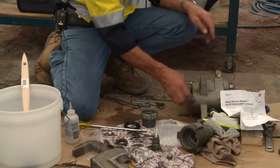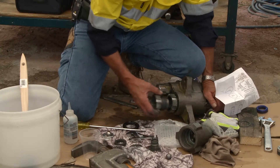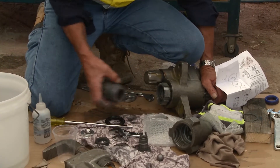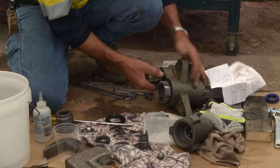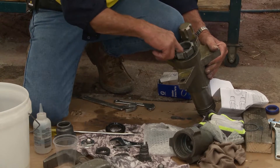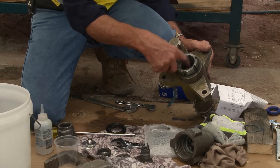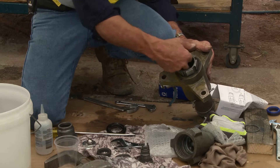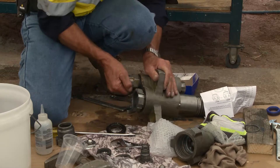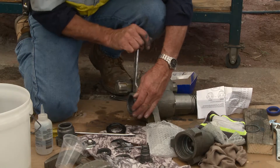What's left here is a keeper for the castellated nut and the oil well. Do you need to take that out? Nine times out of ten you'll have to remove it to get the packings out. The problem is this has a seat in it — the seat is for that retaining ring to sit on — and behind it there's an accumulation of dried materials that need to be cleaned up. So basically you'll need to remove this.